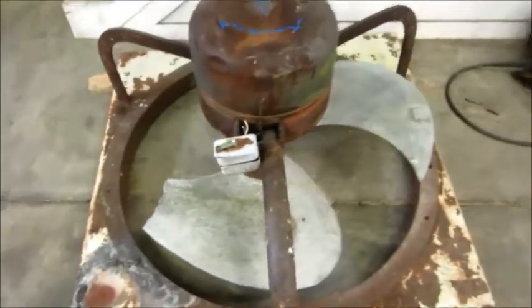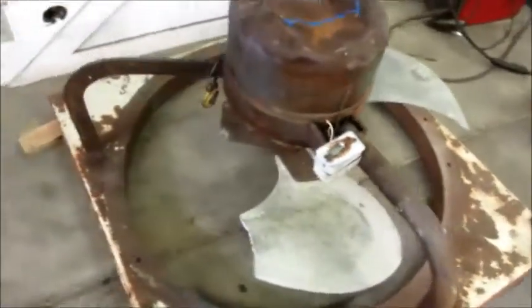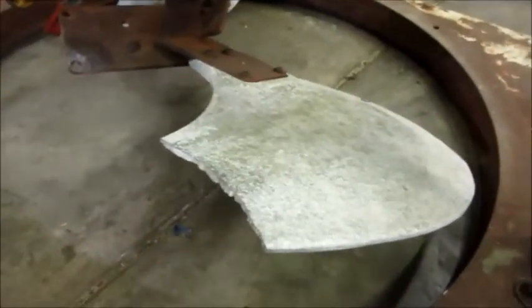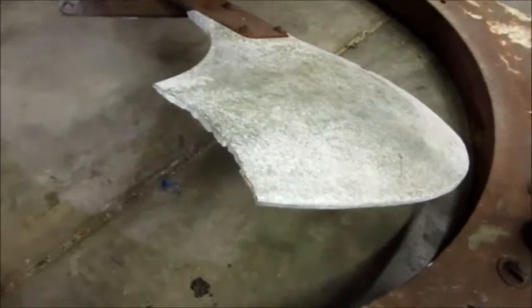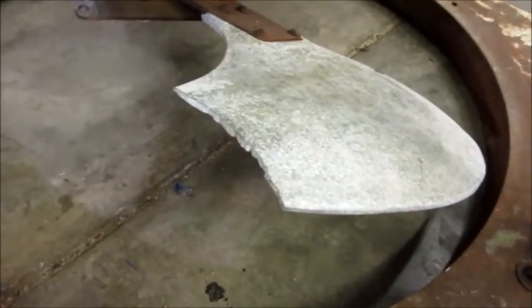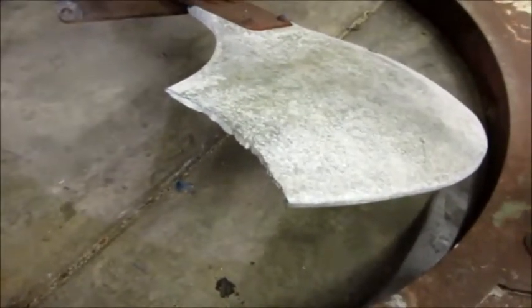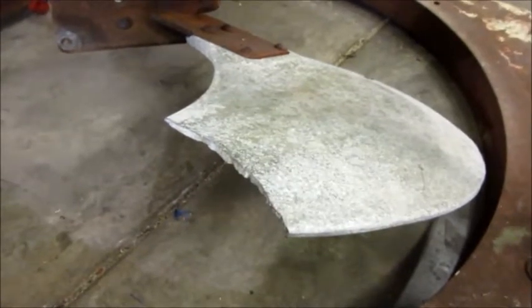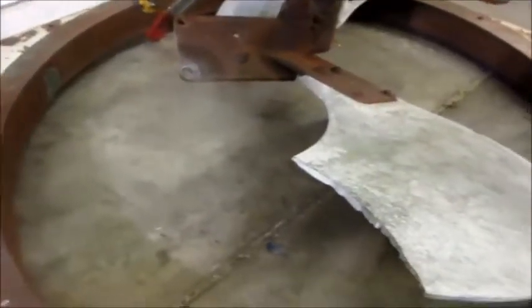I'm going to start on this build — I'm not sure exactly when — I'm just going to try to get it on a stand out of the way where I can be mobile. The tip of that wing is broken on the blade set, and I've ordered some new type of brazing compound that should be able to braze that without cutting it off and exposing completely fresh aluminum, because I still have the piece and it fits on there perfectly. So if I don't have to cut anything off, I'm not going to affect the balance nearly as much as if I had to grind all that and make it newly exposed material. That should arrive next week. And the missing wing I've got over there — there's nothing wrong with that one — on to starting to tear it down.